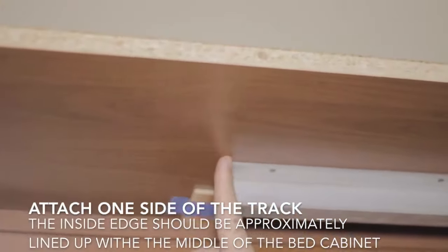You're then ready to place your mattress on, and if you have a tilting headboard you'll proceed to that step as well — we're working on a video for the tilting headboard now. You want to add more springs at this point because the frame will be heavy. To get the right balance, add one spring on the left and one spring on the right, test out the frame, add another pair of springs, and test again, until you get just the right balance so that it lowers and lifts with the minimum amount of effort. Congratulations — you've assembled a Majestic Library Bed! It's time to take a break, maybe take a nap. We always welcome feedback, so if you have any on this assembly process, we'd love to hear from you.